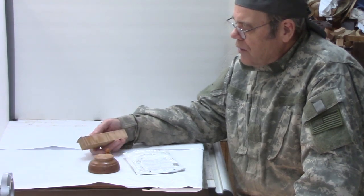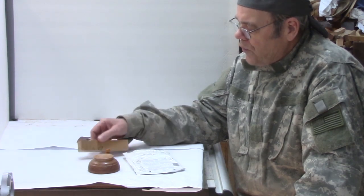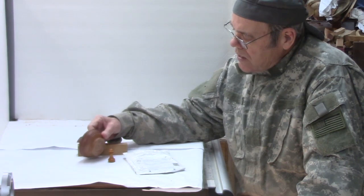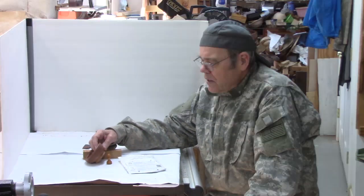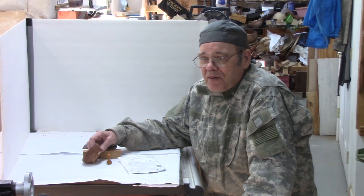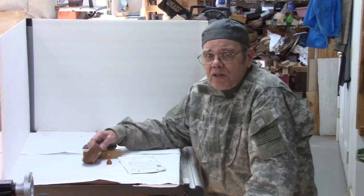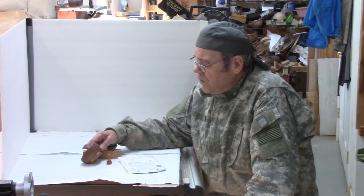The thing about Bradford pear, though, is it can oxidize. There's a piece that had been exposed to air for a while. Here's a little tiny ring bowl, and you can see how it changes to a very dark orange as it oxidizes. All wood will tend to turn dark, and over a period of 20 years, 50 years, 100 years, it's going to be a dark lump of wood, almost no matter what kind of wood or finish you've got on it.